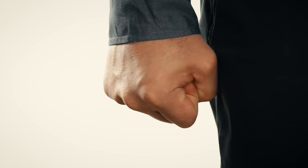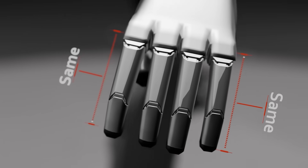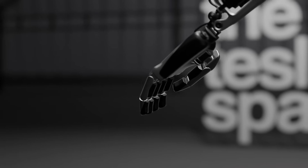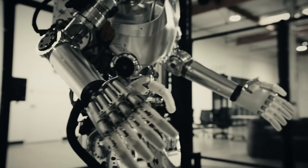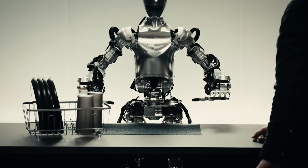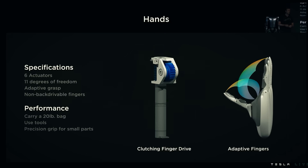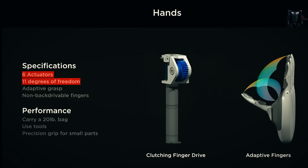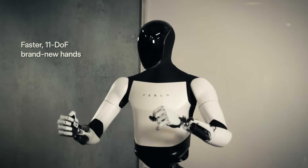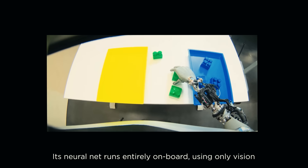Probably better that the robot can't make a fist. You'll notice a couple of interesting things: unlike a human, the TeslaBot has four fingers of equal length, which makes sense from a manufacturing standpoint. And when the robot hand is at rest, the fingers actually curve inwards slightly — just like a person. Comparing with Figure One, that robot does have the middle knuckle, though it may not make the hand more useful. And when Figure One is at rest, it sticks all fingers straight out, which appears much more robotic and unsettling. The TeslaBot hand has 11 degrees of freedom driven by six actuators, with so much precision required that Tesla embeds a small computer controller into each hand to drive the fingers, receive feedback from the pressure sensors in each fingertip, and help Optimus recognize where his hands are in physical space.